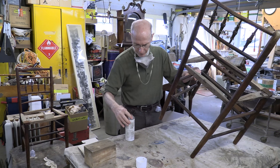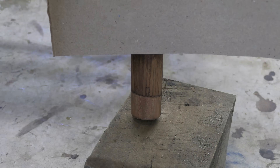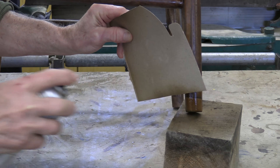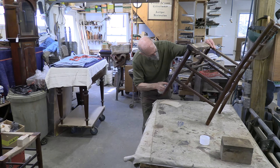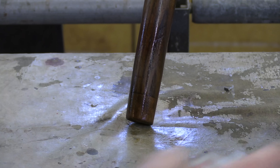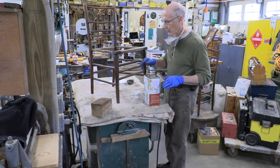I'm going to tone these areas using this perfect brown toner — this is an acrylic lacquer and I'm just going to mist on a little bit. This chair doesn't have a lot of finish on it, so I've got to go really light on my repair area. I'm going to give both chairs a little bit more color, then a coat of Watco Danish oil just to seal it in before waxing, which I'll do after the seats go in. I'm hoping it will also help with these scratched-up raw areas. I'll apply it with a piece of 0000 steel wool.